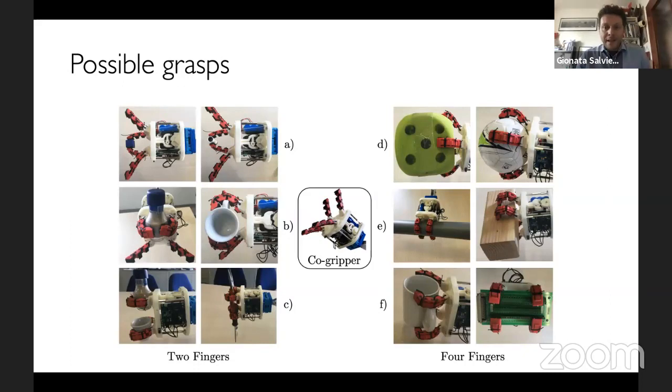You can easily reshape the arrangement of the fingers, because fingers are fixed to the palm with a joint that can be manually actuated by an operator. It is possible, due to the mechanical structure of the palm, to control separately two fingers, couples of fingers that are moved through a differential system and can be separately controlled. And you can see the flexibility and the possibility here to deal with objects with very different shapes.